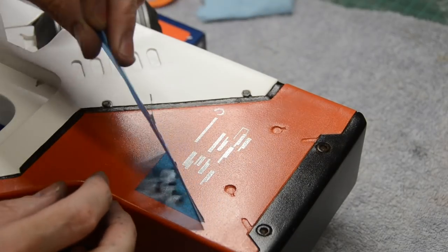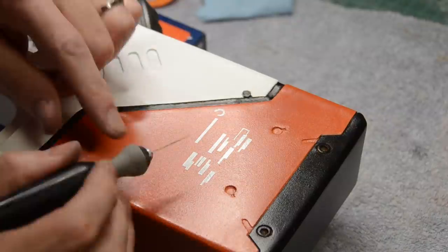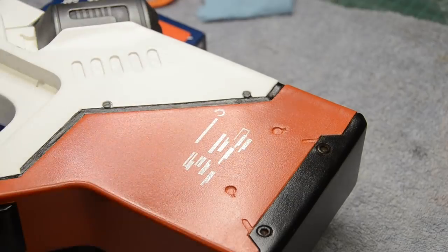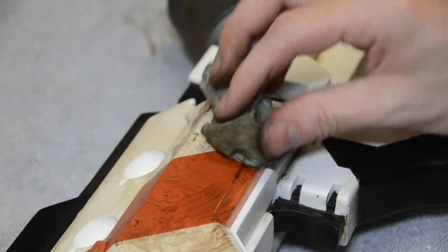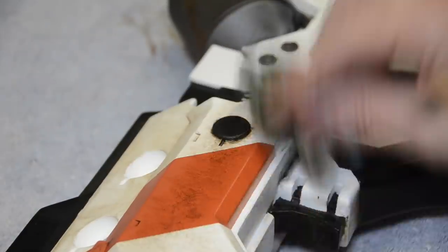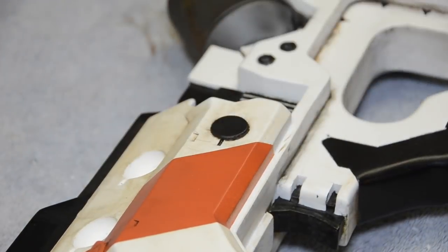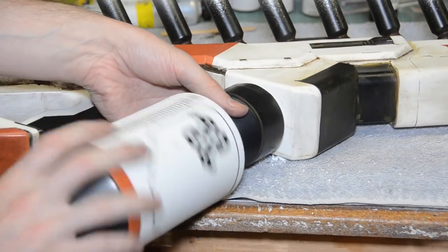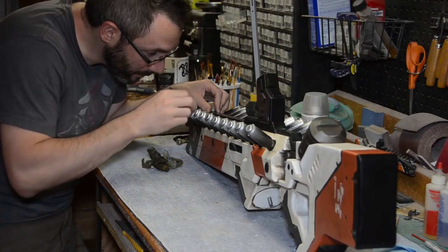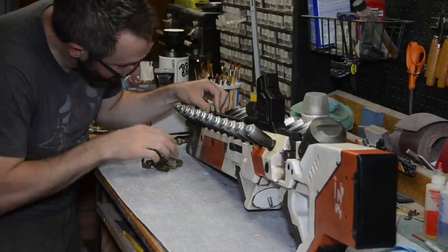For the casting process, is it all the same material — just urethane resin? Yes, actually all the pieces are urethane resin, though I used a couple different varieties. For the slush casting on the big tube on the bottom, I used Onyx Fast that I'd been eager to try since a lot of my prop maker buddies have been singing its praises — it worked really, really well. The rest was done in Smooth Cast 300. So you're casting it, Frank's casting his hand — let's go back to Comic-Con and look at those final finished pieces.